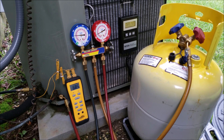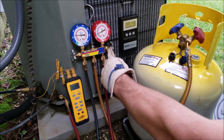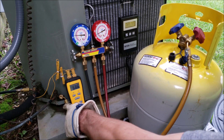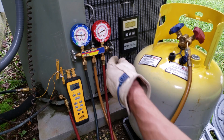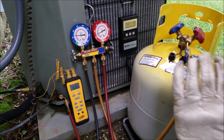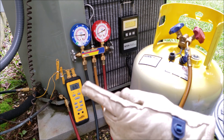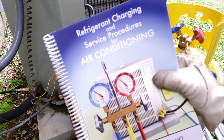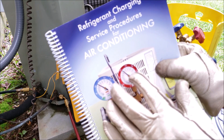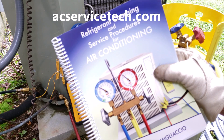When recovering refrigerant into a recovery bottle on a system with a TXV, recover as slowly as possible because you're affecting the amount of liquid heading into the TXV, and it needs time to readjust. Give it extra time between decharging intervals before checking subcooling again. I went inside and checked the delta T — we have 18.5 degrees of temperature drop between the return and supply registers, inside temperature is now 70°F. If you want to learn more about checking refrigerant charge and troubleshooting using saturated temperatures, superheat, and subcooling, check out our book and the full outline at acservicetech.com.